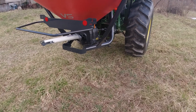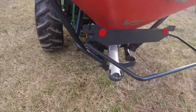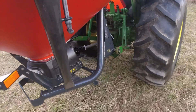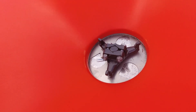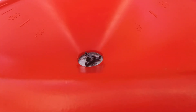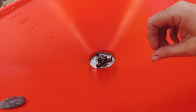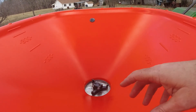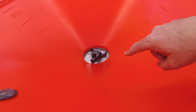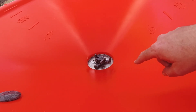I can go back and buy the add-ons without going through the parts counter, which was good. Inside this tub there's a huge agitator — much bigger than my hand. It doesn't look very big on video, but on my Lely the auger was just a little nub and it would get clogged with fertilizer. Some of the tractor supply type spinners are kind of the same way. If something gets down in the bottom of this spreader, that cast iron agitator is going to knock the crap out of it.